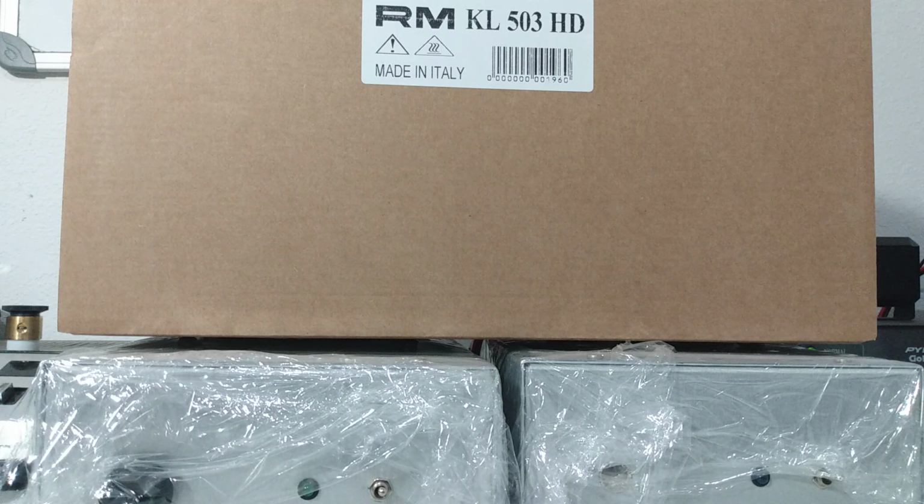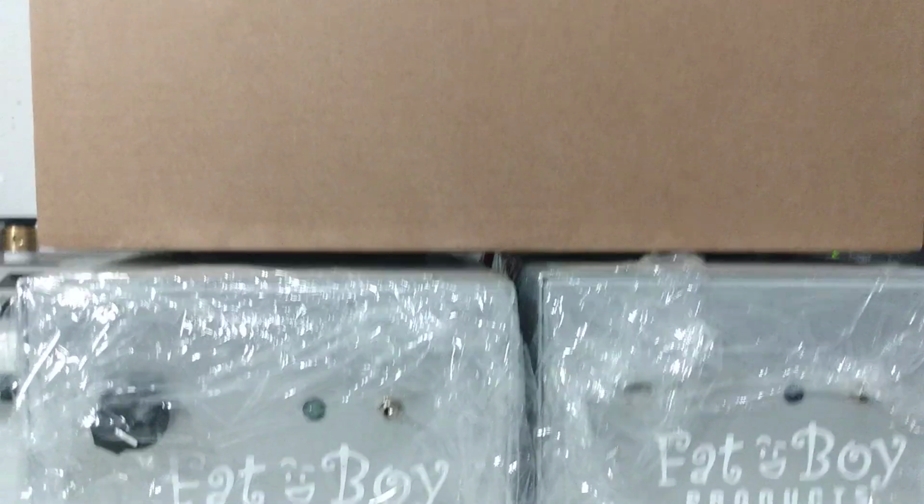It's a higher drive than the original 503. I wouldn't call it a high drive. It's labeled as a high drive, but like I said, in the grand scheme of things, it's not really a true high drive, in my opinion. Again, that's confusing to folks that aren't in the radio business and haven't been for a while. They look at high drive and think, okay, every amp that's a high drive can take 4 or 5 watts dead key. So that's the story on the 503.